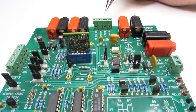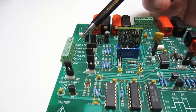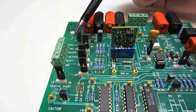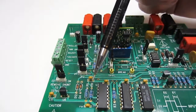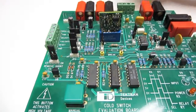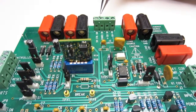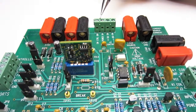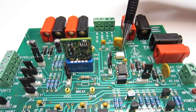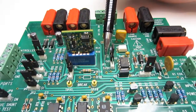I won't take time to go over all of the optional controller connections here, since they are clearly marked on both the board and in the schematic. Unless you are controlling turn-on with your own controller, none of these connections are necessary to conduct tests with this board. You can simply use the manual latching toggle switch button here. We have two optional output terminals here to control your high-voltage power source rail.